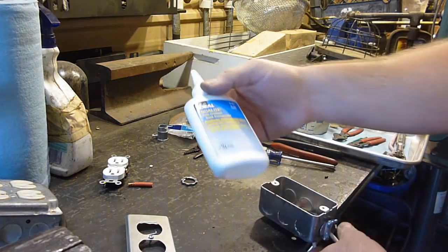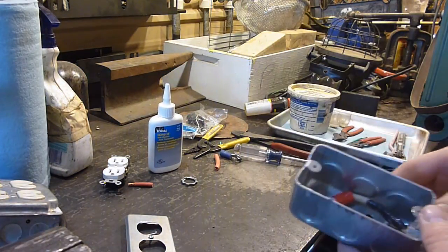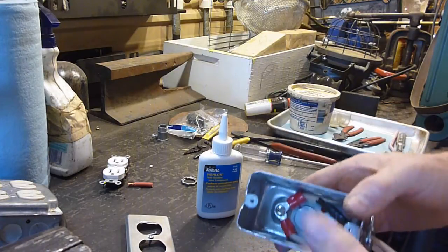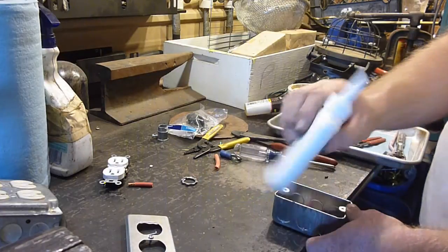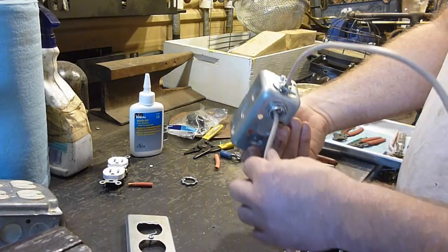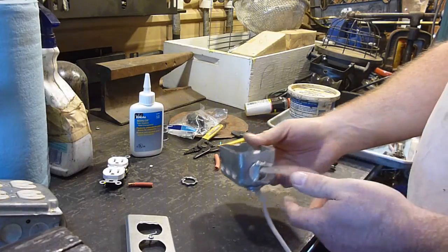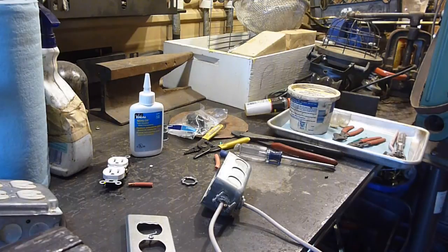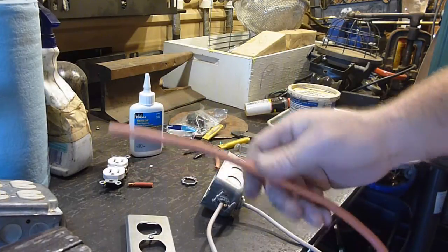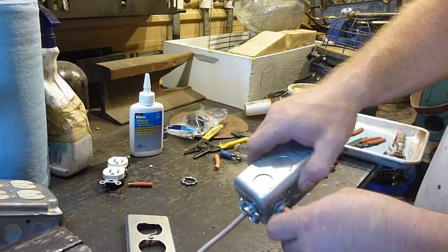I wound up having to do two separate clamp fittings just to try and fit everything in. There's just a screw here — normally you'd want a green grounding screw, but this box is one I had. I put a little Noalox on all my terminals when I hook them up, especially the ones outside, since those are the ones I'm most worried about. So I've got one wire going to the charge controller and one wire going directly to the chassis ground.